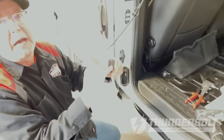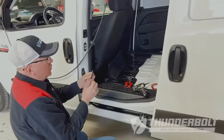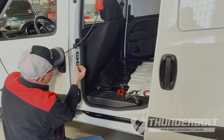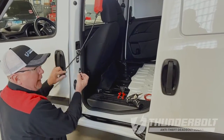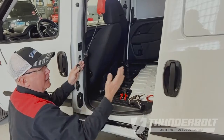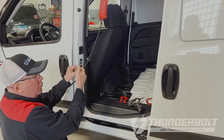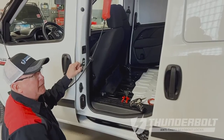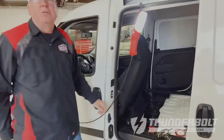It's difficult to solder leads onto these pins without overheating them. Once you have your hole drilled, you have the ability to move the plate around and line your contacts up before you drill your holes and put either your screws or rivets in place. Take your time, measure twice, and drill once.